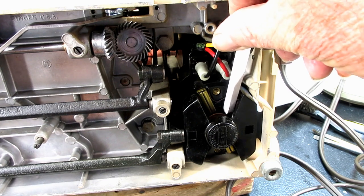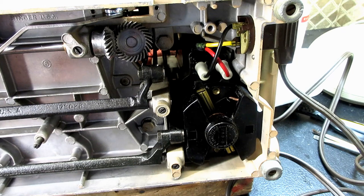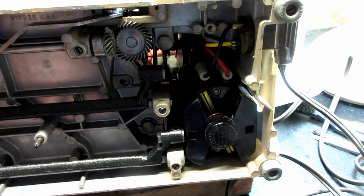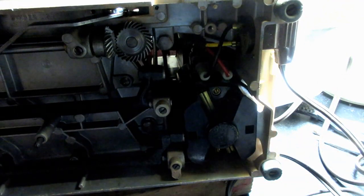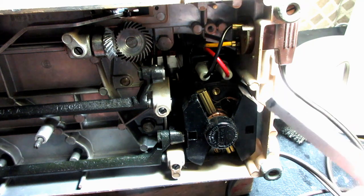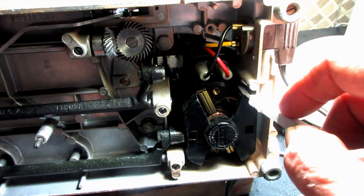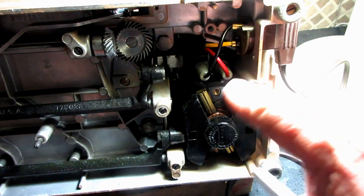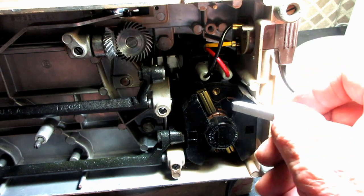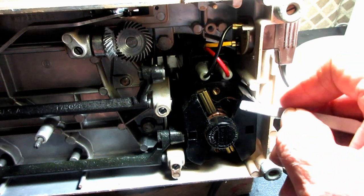I'll try to get a steady speed here. Maybe I should turn off some of these lights because looking through the back of the camera you don't see a whole lot of what I'm doing. Let's see if that makes it show up a little bit more. You just lightly rest this on the commutator and move it around a little bit — you don't want it to wear a trough. You don't push hard; you don't want to wear away all the copper. You just want to clean off all the carbon deposits from the carbon motor brushes.